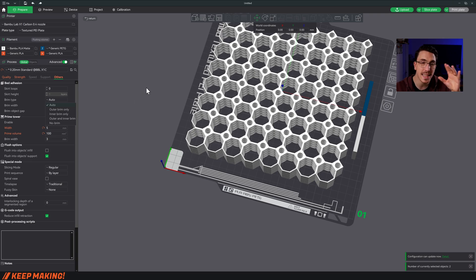If you're having adhesion problems, first sort out your build plate level. Also clean your build plate — and don't use isopropyl alcohol, as that creates a hydrocarbon layer. The best method is literally just some dish soap and water: clean it up, make sure your hands are clean, rinse it all off, then use a paper towel to dry it. And make sure your hands do not touch the build plate afterward — there's so much oil on your hands that it makes the surface slick. For my PEI textured build plate, a quick clean like this always fixes it.